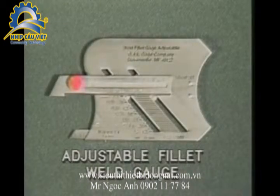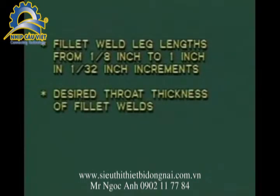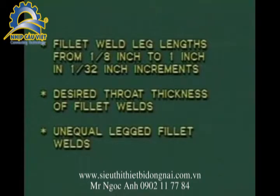The adjustable fillet weld gauge was designed so that just one gauge can be used to check 15 different sizes of fillet welds, equal or unequal in size. With this gauge, you can measure fillet weld leg lengths from 1/8 of an inch to 1 inch in 1/32 of an inch increments, desired throat thickness of fillet welds, and unequal legged fillet welds.